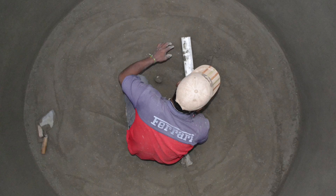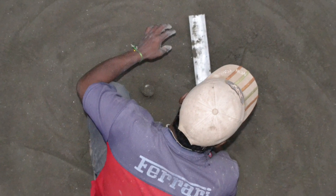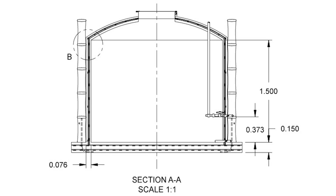The major design considerations for this foundation were the amount of water sitting on top of the tank and how that load is acting on our foundation. To account for that load and weight of water, we kept a small depression in our foundation to provide equal load distribution and to prevent the possibility of our foundation buckling upward due to pressure on the walls of the tank.